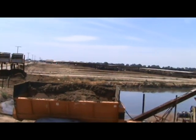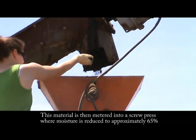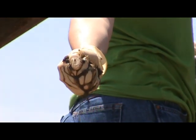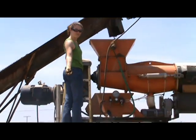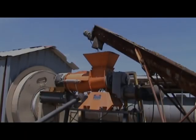After falling from the slope screens, the material is loaded into a feed wagon. From there, the material is fed into a screw press. Even after spending some time in the sun, there is still a lot of free water that can be squeezed out by hand. The screw press reduces the moisture content to around 65%.